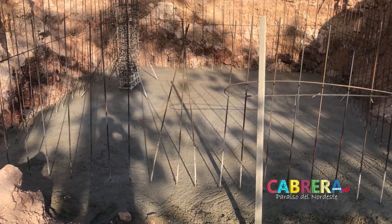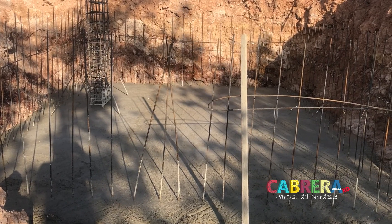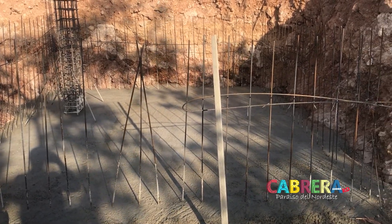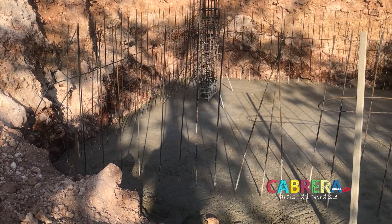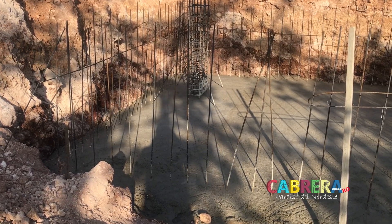We're about finished. Hey Keiko, how thick is that pad? In inches? It should be at least 10 inches. There's not much more to tell you about today because it was an all-day thing. I showed you this morning how they wheelbarrow it in, and we're about a 10-inch slab on all that laced and reinforced metal underneath.